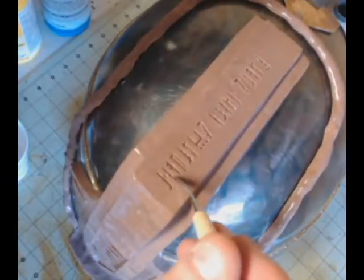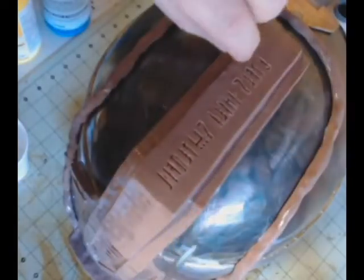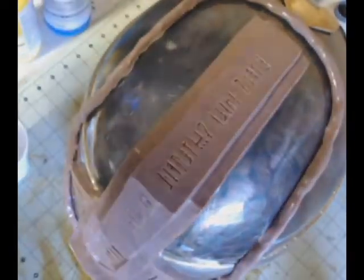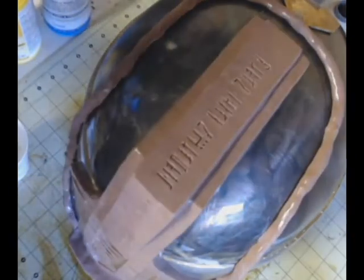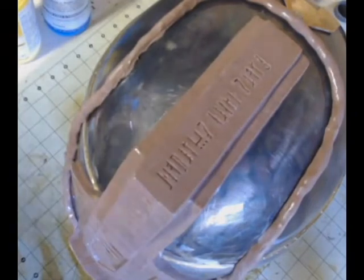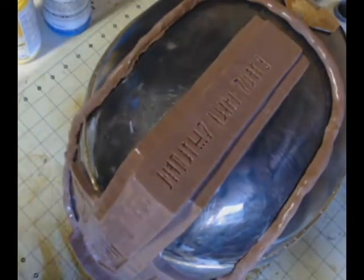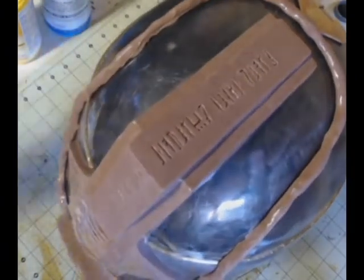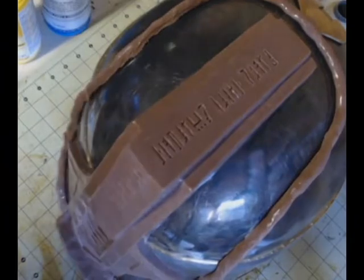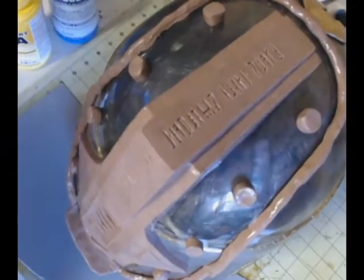At this point, after I've sprayed all of the solution, I'm just going over to make sure that I don't have any hairs in there, and I don't have any foreign objects on the clay before we start to pour the silicone, because that will just get trapped in the silicone and it'll contaminate your mold. So you want to make sure you don't contaminate your mold. It's of primary importance. Do not contaminate the mold.